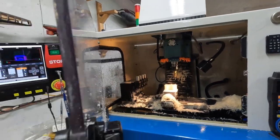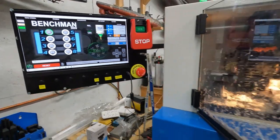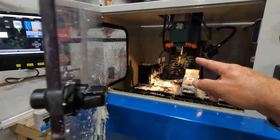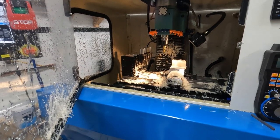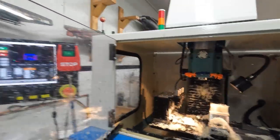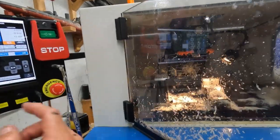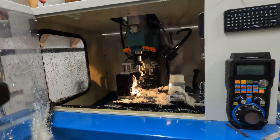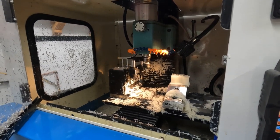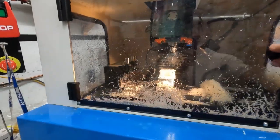I've got it cleaned up. I prompt the machine to move to the next step cycle — it moves over and prompts me to remove the tool. I pause, remove the end mill so I don't damage it while holding the phone, then hit the prompt again. Now it raises up, goes down, picks up the chamfer bit, locks it in the drawbar, and once it clears the plate it drops back into rest position.